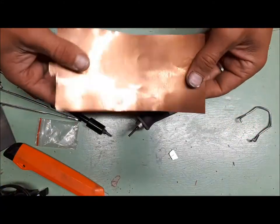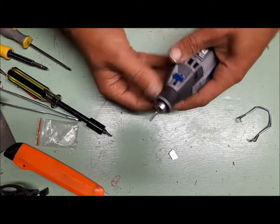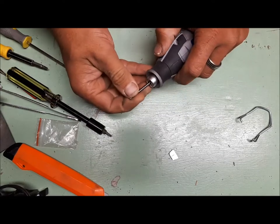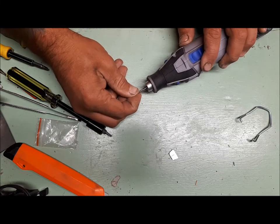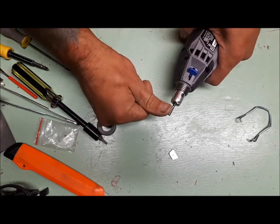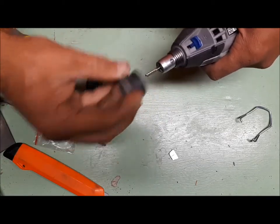More or less done. I got this copper plate — 0.1 millimeters thick — and I shimmed it around the bearing in the slider lock mechanism. The bearing that was in the rubber, I shimmed it as well to 0.4 millimeters on each side. Hopefully that will sort it out. There's still a little bit of play, but the situation is much better than before. Before, without pressing very hard it was already touching the walls — that's where the friction and vibration came from.